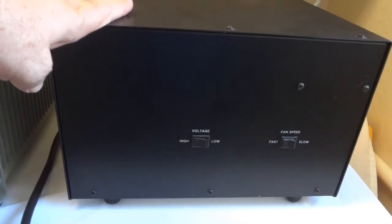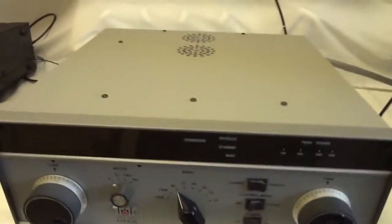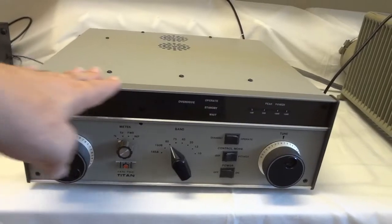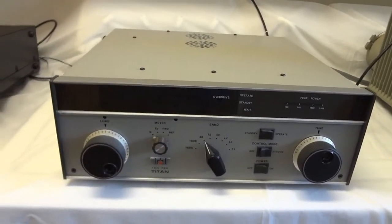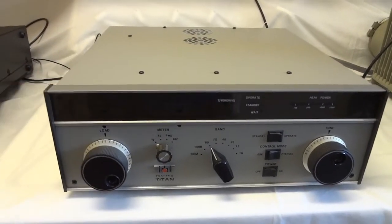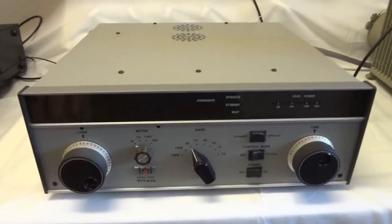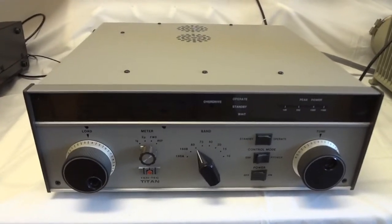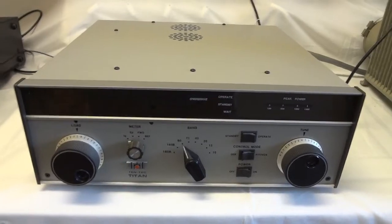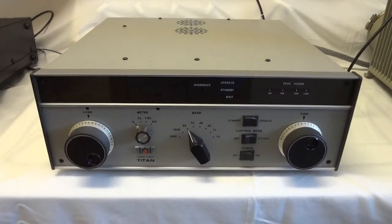The separate power supply is quite nice — it means you can put the amplifier on your desk, and without the power supply it's not that heavy, so it's comfortable on a desktop. It also means the entire case is used for RF components, making it a very roomy and spacious build. That prevents arcing and other nasty problems. If you look at Chinese and Russian boxes available today, everything is in a single box making the RF deck very cramped, which causes arcing. With this amplifier you won't have that problem — it's built like a tank. TenTec also did a lot of work for the military, and when you see the insides it clearly shows excellent quality and very good design.